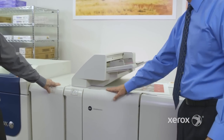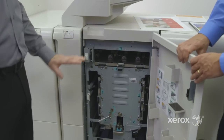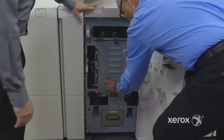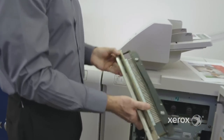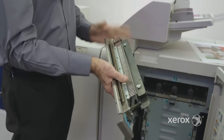Tell me about the GBC Advanced Punch Pro. The GBC Advanced Punch Pro is a model that supports changeable, customer-changeable dies. You go in right here and unlock that. The customer is able to buy a variety of punch dies that support different patterns. For example, this is a C4 model. If they want to make adjustments — to remove pins so there are no perforations at the margins — they can disassemble this and remove pins.